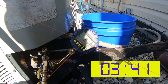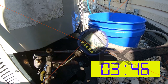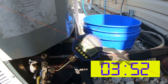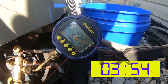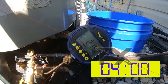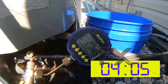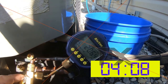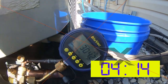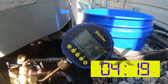When you've got the fancy hoses, you kind of want to just say, screw it — let's just go a little bit better. I mean, we've only got six minutes into it total. Normally you'd be going for 30 minutes with quarter-inch hoses and then not even checking your microns at all. Does it work? Yeah, it works. How long it works is the question. It all comes down to how important it is to you that you know you did the best job possible, and if there's any failures, it was because of something you did not do to help contribute to it.